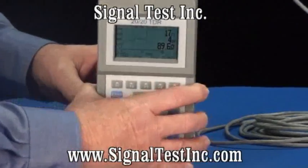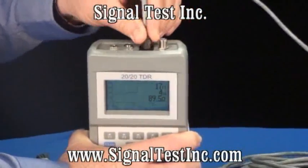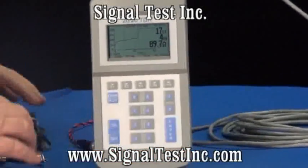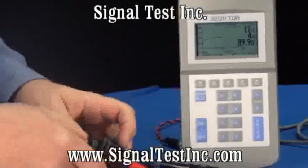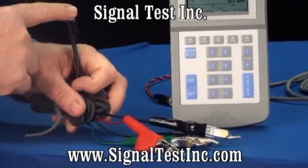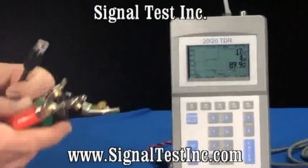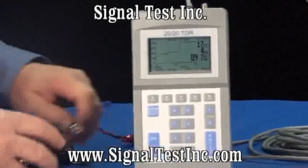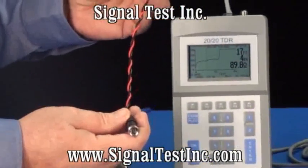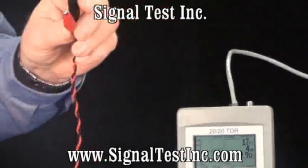The connector on the top we're using right now is the RJ45, with the cable plug directly in. There are other ways in which it can be connected. One is using the telco leads which are supplied with RJ45 units — we have an RJ45 plug on one end and two sets of clips on the other with telco clips for getting on a 66 block. A third way you can connect twisted pair to the TDR, if you only have a coax port or want to use the coax port, is by using the lead that we supply with alligator clips.